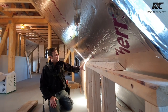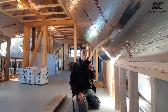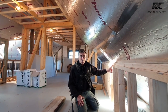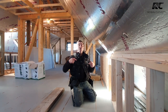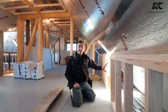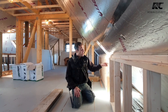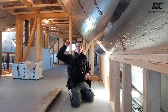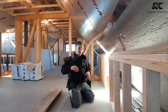Quite often in a roof construction or loft conversion, these void walls — you might call them ashlar walls — are structural. I've spoken in previous episodes about how I designed this roof to enable me to add these walls afterwards, so they were a partition element, not a structural element. The reason for that was to get this beautiful continuation of insulation from the ridge all the way down to the wall plate — coming back to the thermos flask idea.